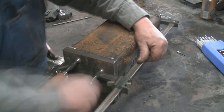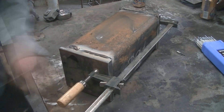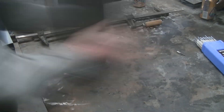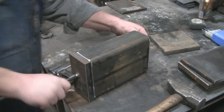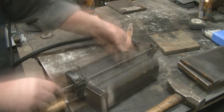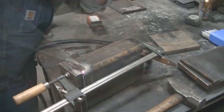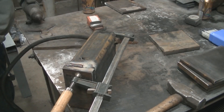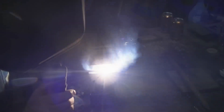You're going to notice that the tube says Floyd on it from Floyd Equipment, so everything in the shop gets a name — this guy is going to be Floyd the Forging Press. The upper portion is a four-inch by six-inch tube, three-eighths wall, with a five-eighths inch plate on top. The ram will sit right on top of that, and on the bottom we'll put a six-inch square plate, quickly turning this log splitter into a forging press.